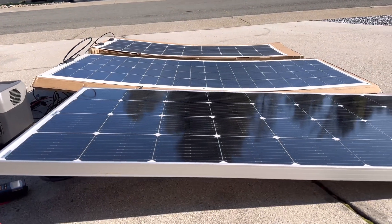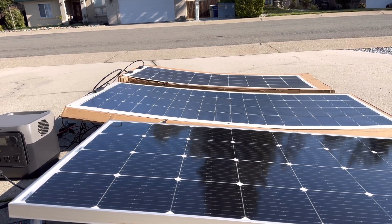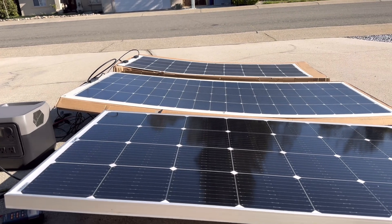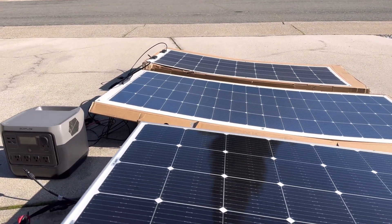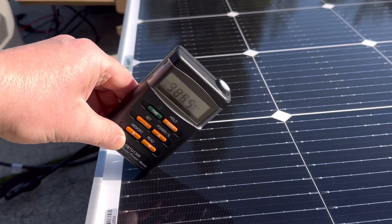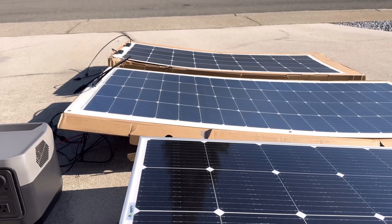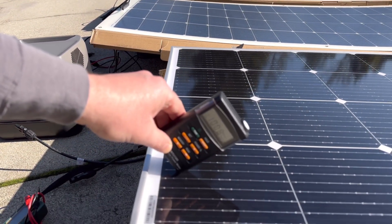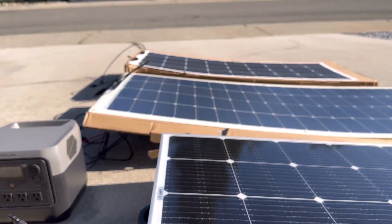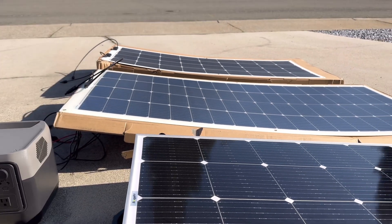Taking a quick look at these — the rigid panel is nice and straight, while the other two are on cardboard boxes and are just slightly curved, kind of concaved in, so they are bowed in slightly, which might affect them a little bit. Ideally, you'd want about 1,000 watts per square meter of light coming through, but when solar panels are on a roof, an RV, or a boat, you don't always have ideal conditions. That's why STC — standard testing conditions — isn't really real world. I'm testing them as if they were on top of my RV with the sun low in the sky.